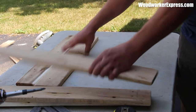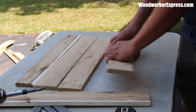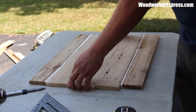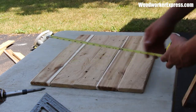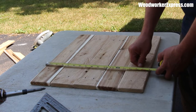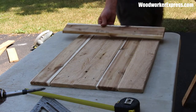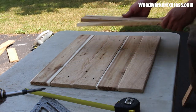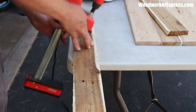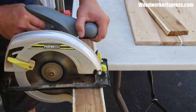Next, I'll line up all of my freshly sanded pieces to lay everything out and put my back support piece that's going to connect all of these pieces together. I measured my width and deducted approximately one inch from that length. Taking two pieces of scrap pallet wood, I'll transfer that measurement — which is roughly 16 and a half inches — to these pieces, then clamp them down and cut them.